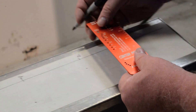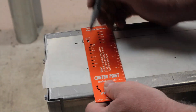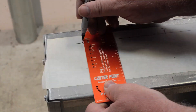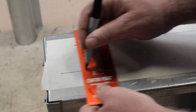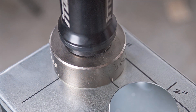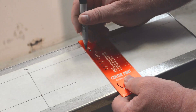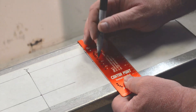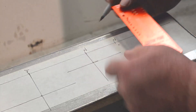If you want to be really precise, you can come back down here and align your center point tool along the edge. This is going to give you the four points of your knockout tool, for your gear punch knockouts to align perfectly on those four points. Then it won't matter what size hole you drill — you can always align those four points with your cup and cutter.